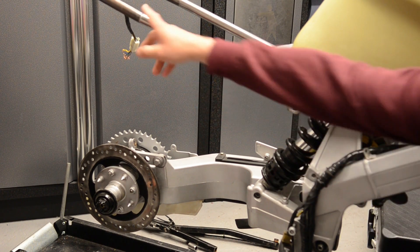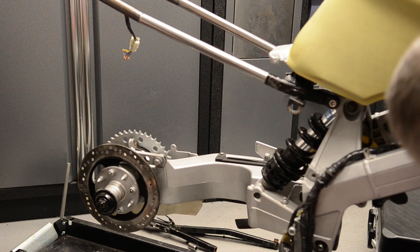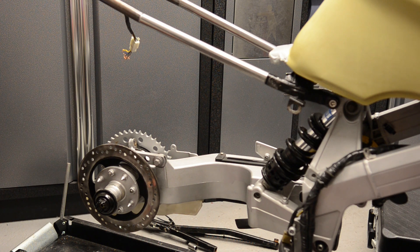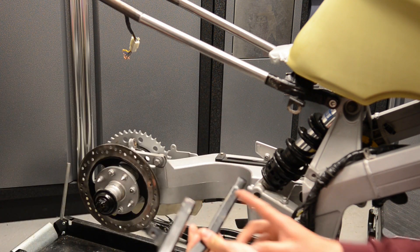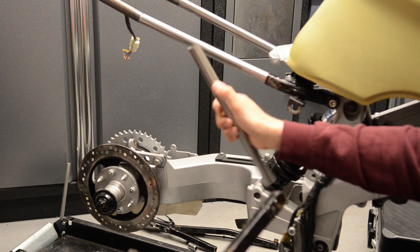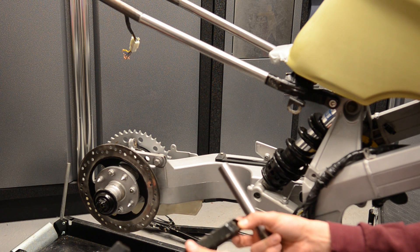Before welding up the last bit, I could technically make a mound for a second support point, but I don't think it'll support the weight well. So I'm going back to what was originally there - I'll chop off a small amount of it, sleeve it, and do the rest with tubing. That tube will need to be cut at an angle. First I'll chop the two legs off and mark them left and right so I don't forget which is which.